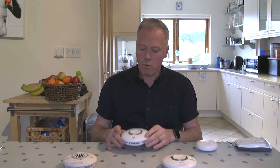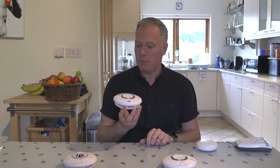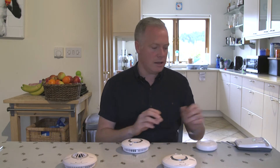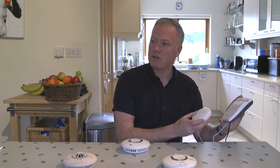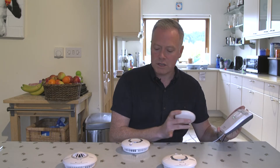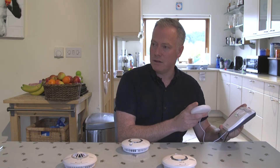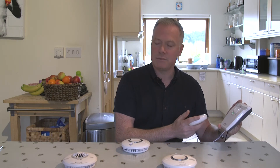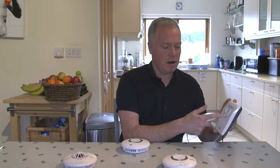The alarms form a mesh network, and once I take this alarm off the base plate to go through the unlearning process, the monitoring device in the network — which is the pad and strobe — is able to be a monitoring device because it's AC powered and has the power to monitor everything going on in the network. Once I take this off the base plate and the signal has gone around the network, the pad and strobe will then realise it's been taken off the base plate and the amber light will start to flash to say: check your network.